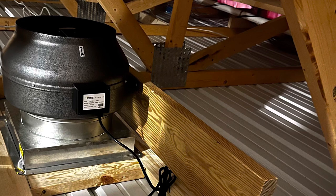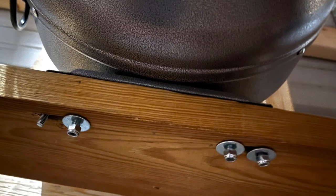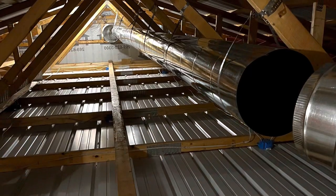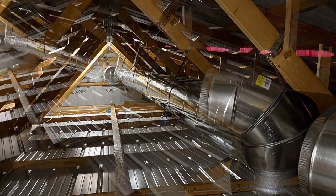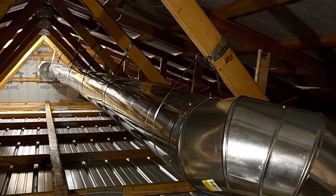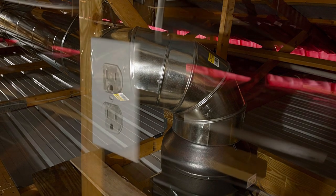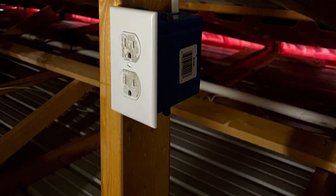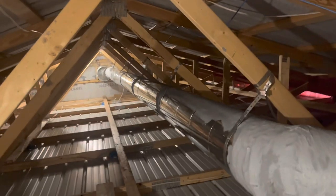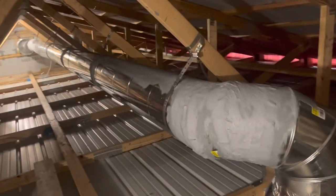You can see the mesh tape — you just paint the sealant on, but it's like a cross between mashed potatoes and Elmer's glue. It's nasty and sticky but it adheres well. Once dry I'll go back and do a double-check for anything I've missed. The fan is held with four lag bolts into a piece of 2x8, which carries the weight. I connected it with adjustable ducting pieces and had to cut one to get everything to fit. There's also a small electrical box installed since the fan has its own plug for easy replacement.